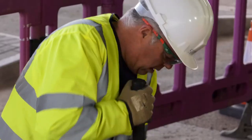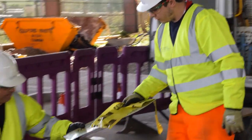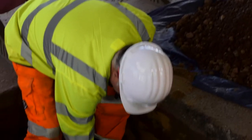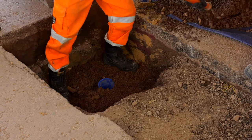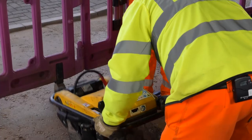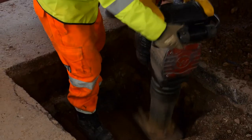The fine fill material may change depending on your client's requirements — it may be sand, limestone dust, pea gravel or another. Don't forget to replace any marker tape or other similar indicator. Remember, if more than one apparatus is in the excavation, they should also be protected by fine fill when you have reached that level. Every lift of GSB — granular sub-base material — afterwards needs compacting using mechanical equipment. So to achieve this, we need to add a surcharge. The SROH shows compactable lift thicknesses.